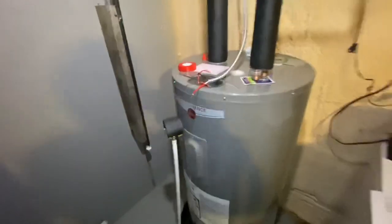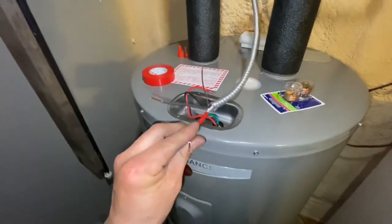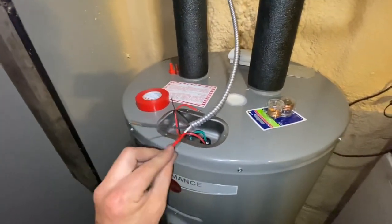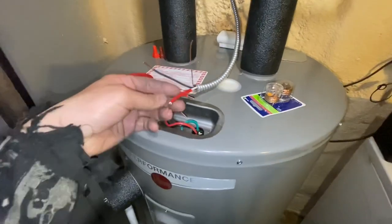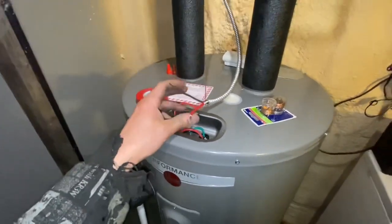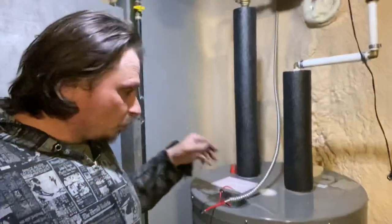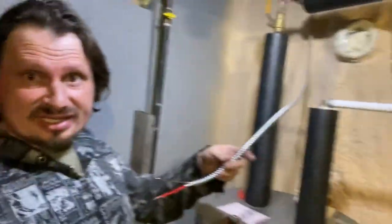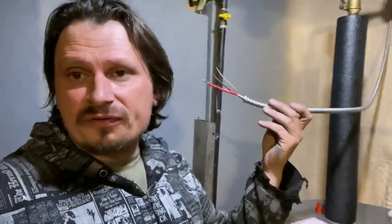What you have to do is take the white wire and put red tape on it — it has to be black and red for 240 volts. Since our wire is exposed, we're using metal conduit, which is what you're supposed to use when it's exposed. If you were running this to a plug-in for an electric heater you could use regular wire, but it still has to be 12-gauge or whatever your device is rated for.